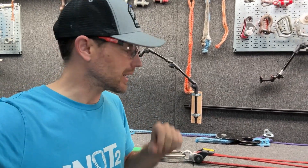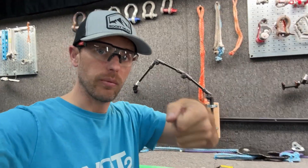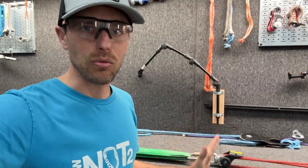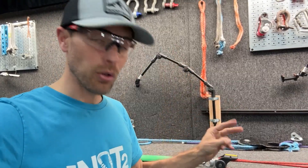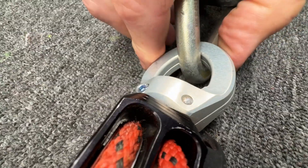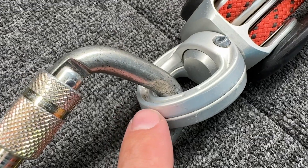Fun fact about pulleys — I've used a lot in slacklining. If your feet are planted and you're about my size and weight, you're going to get about 100 pounds of force, and you're not going to get perfect 100% efficiency out of any pulley. This is going to give you a 5-to-1 if used a certain way, so you're not quite going to get 500 pounds solo. With two people pulling you could get to four kilonewtons, and it's supposed to slip at four. If you put four people on this it still might not slip. I think it's going to break at 45 kilonewtons. The swivels are two-part bolt together — they might pop one of these screws and come off the posts. My gamble is right there.